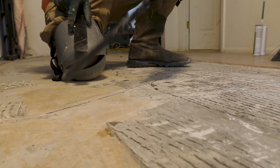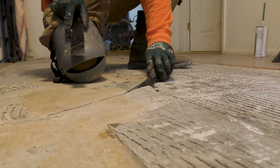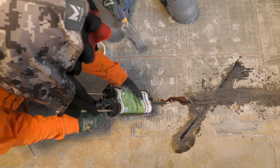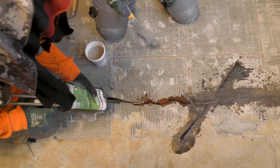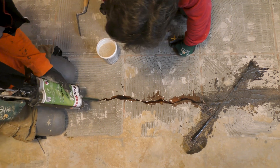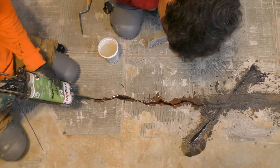What exactly is used to repair a cracked slab? At Arizona Foundation Solutions, we use a combination of a carbon fiber laminate as a way to bridge the separated slab. Low viscosity polyurea is fast-moving and easily makes its way into the crevices of the established crack, which will secure the slab. Adding the carbon fiber laminates works to strengthen your slab and prevent further cracking.